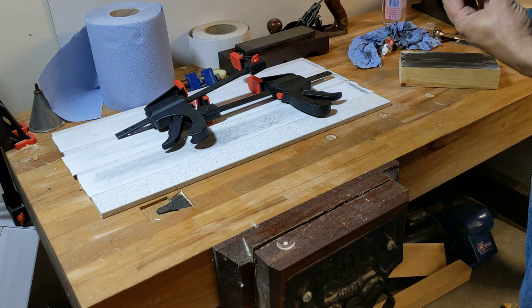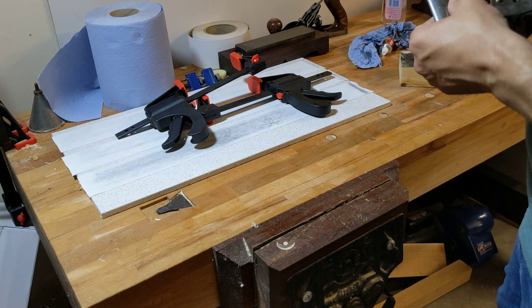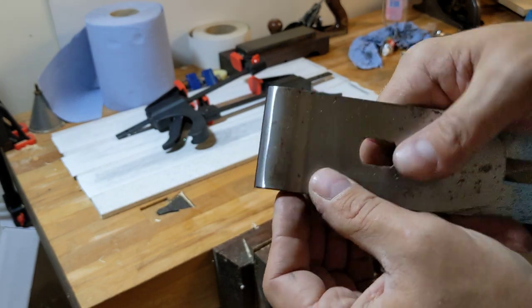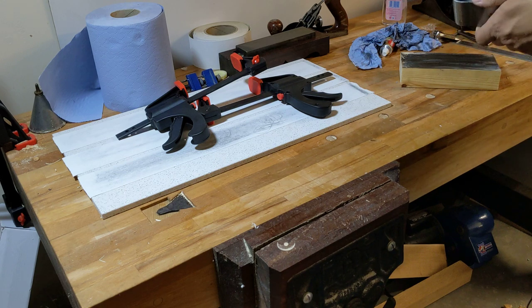Again, don't go for crazy tight on the cap iron settings. That's a whole video within itself. Just something in that region is fine. You don't want too much resistance, something like a mil, mil and a half. No problem at all.